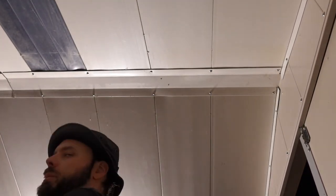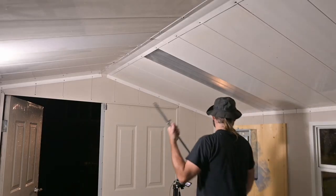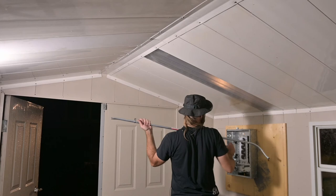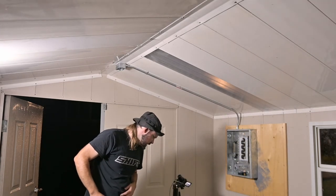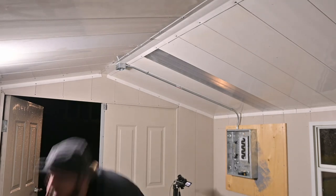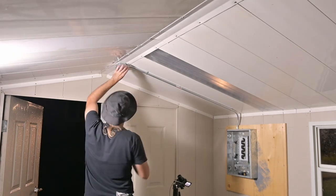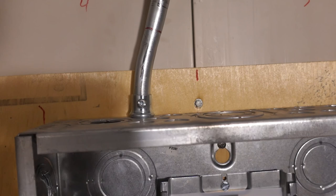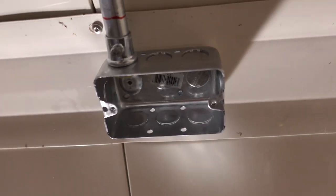Along with this side — which is good because it doesn't go as deep as I'd like it. Once again, we pull to the back and finish up. Now, another thing I might consider doing is sealing those holes. I'm going to have to bust open another tube of caulking so that I can make sure in case water does get into the center beam, it can't leak back into the electrics. We officially have our first piece of conduit installed, and that junction is going to service the lighting.